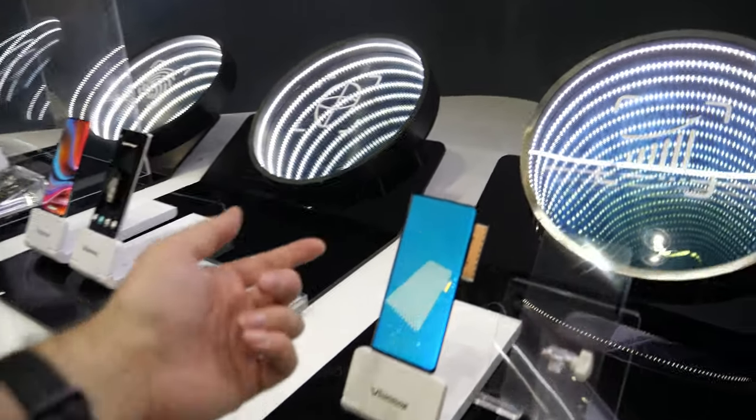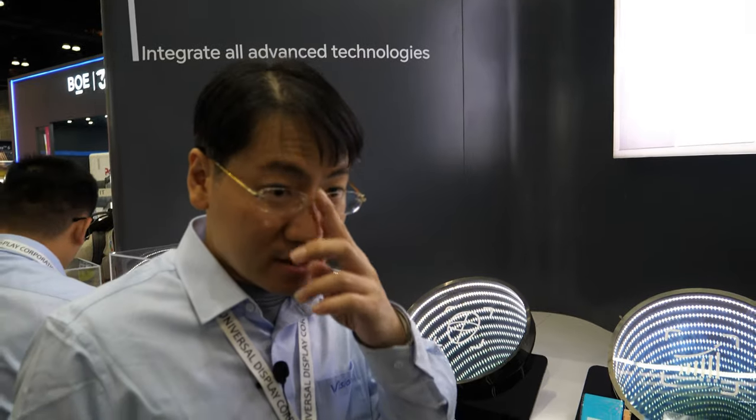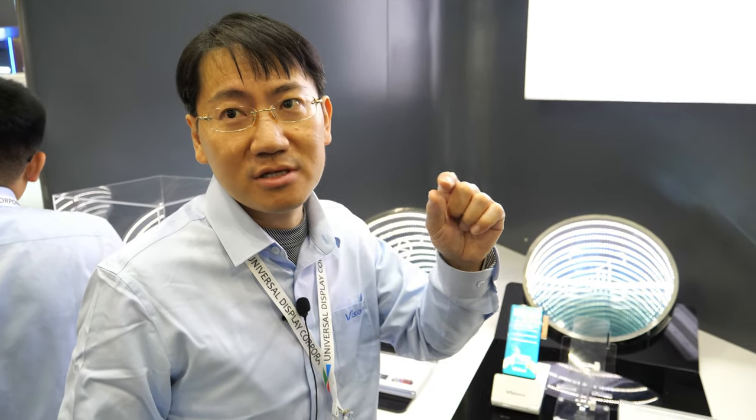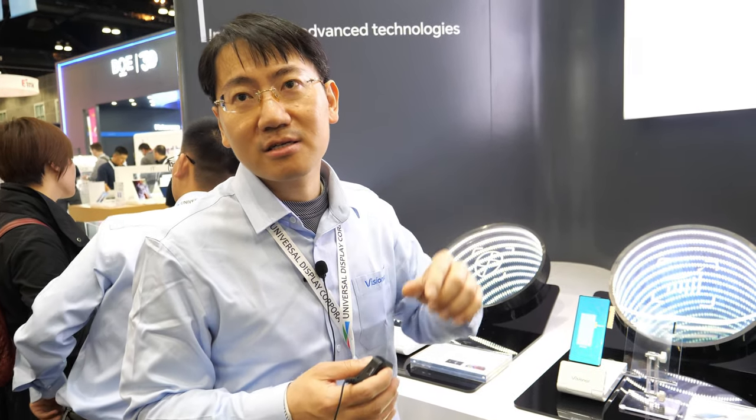What did the normal antenna have, like in every corner? But actually, you are right. The thickness, the antenna height actually is very limited. The antenna height is very important. So the area is not the first priority. The height should be the first priority. So it depends on the frequency. If the antenna frequency is higher, we need a lower height to do efficient radiation.